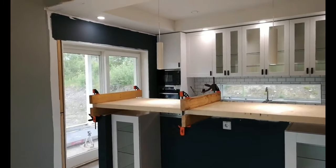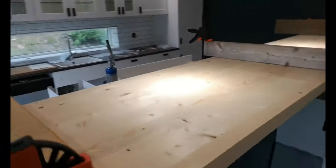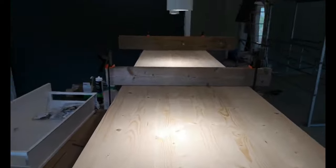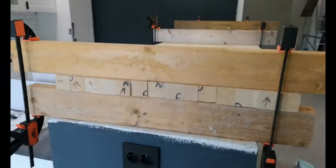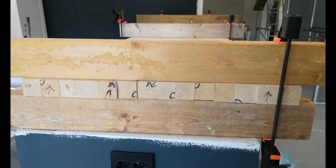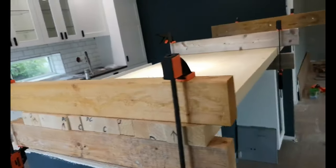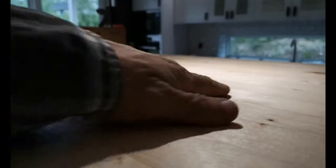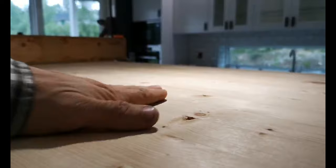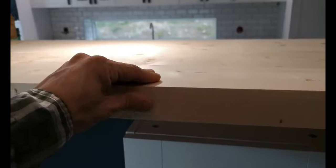So you didn't see a lot of videos from making this, but I'll have a whole staircase to do the same way, so I'm sure you'll get plenty of videos of thickness planers and other things. I've got that thing strapped down right now just so that I can maybe try to avoid it being so cupped. It basically looked like a bowl yesterday. Well, not exactly a bowl. Anyway, it wasn't flat. But boy, it turned out good. I like it. For it being just pine, I think this is gonna turn out just fine. It's almost 2 inches.